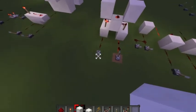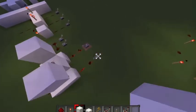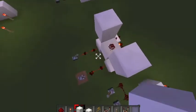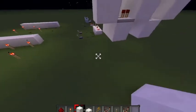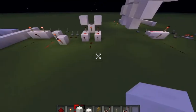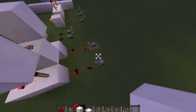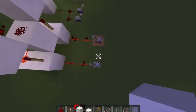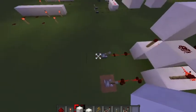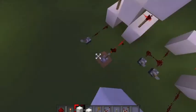But of course we come across the problem that we need to move it over to the next bit if this happens. So the way that you need to solve that is you need to take this signal, and if this signal is also on, we have to move it over to the next bit. And if that signal is also on, you have to keep moving it on, and so on and so on. So basically, if the bit that we're adding to is on, well, the digit that we're adding to, the technical term is bit. I think I'll start using that from now on. Well, the bit that we're adding to, if its natural value is 1, then we're going to have to carry it over to the next bit as well.